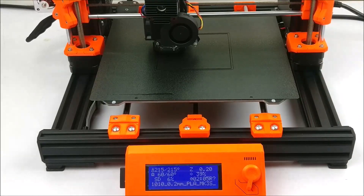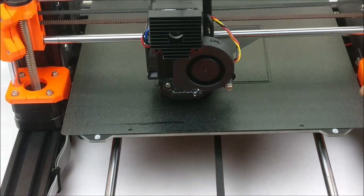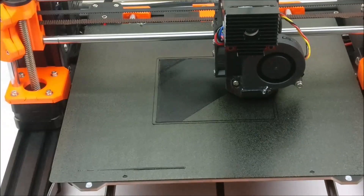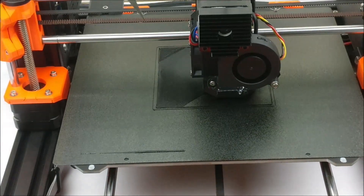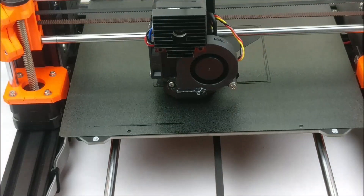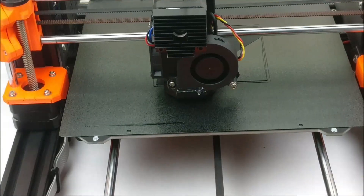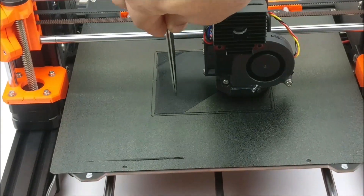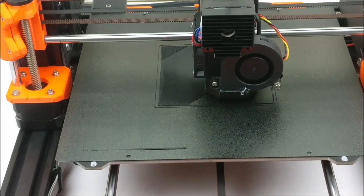If it sticks fine then leave it at that point. Now if you look at this corner, you will see it has not stuck properly to the plate, because at that point we decreased the value — hence the gap between the plate and the nozzle increased. That is why the layer has not stuck properly and is slightly forming waves. But once we decrease the gap by increasing this value in the negative direction, you can see that the layer is sticking perfectly to the plate. So this is how the live adjust Z value works.